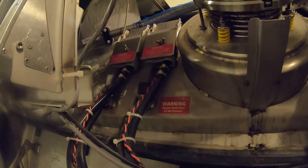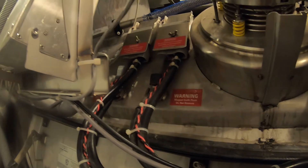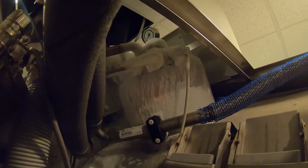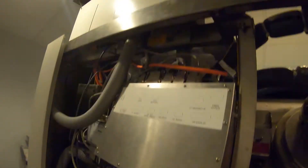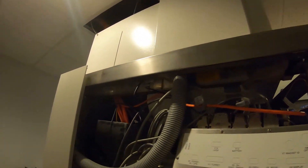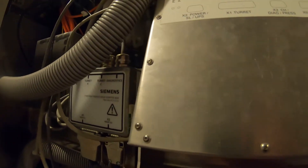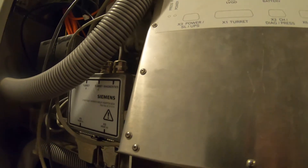Good afternoon. We got a call this morning — we were looking at a monitor and saw the helium was down to 31 percent, which wasn't good on this Symphony Tim system. We got in this morning and it has quenched. What we're going to do is take off all these covers and see if the burst disc is broken, because it is not holding pressure — it's actually gone into the red.